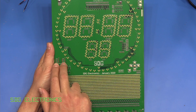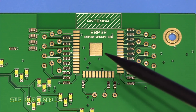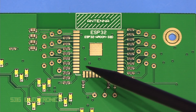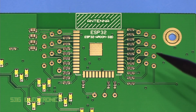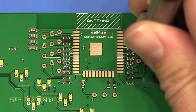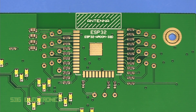Let's have a closer look at the PCB. You'll notice that two of the parts didn't get placed — unfortunately they were out of stock when the PCB order went through, but I've got some in stock so we can solder those on. Here we have the footprint for the ESP32, and we've got a series resistor in line with every GPIO pin on the controller. So if we do have any trouble with the ESP32 driving the entire matrix, we can just lift that resistor and tack on another board on the back of the PCB — something like a PIC24 or PIC32 — connected to these points around the ESP32. These test points have the right diameter so a scope probe can just poke in and it holds really quite tightly, providing good accessibility for both scope probes and any pins we might want to use to modify the PCB.